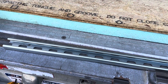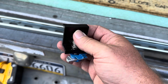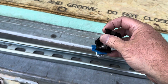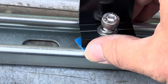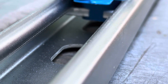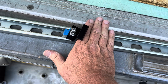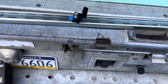The way we're going to connect these solar panels to the strut is with these clamps — I got these on Amazon and they're made for use in a strut and they're made to hold solar panels. This one is for the end. This metal part goes down inside the track and you spin this blue plastic part, which moves that metal piece to get underneath the unistrut. Then on top, the solar panel sits here, this goes over the edge of the solar panel, you tighten it down, and it pulls that solar panel right down onto the strut.